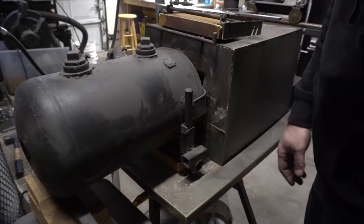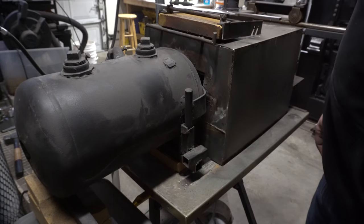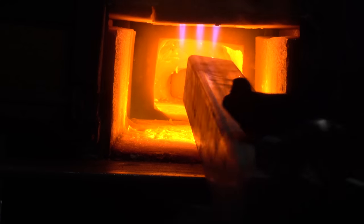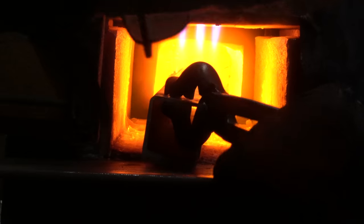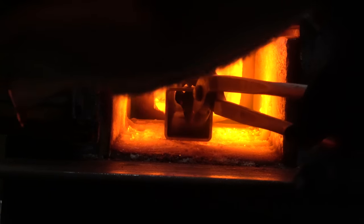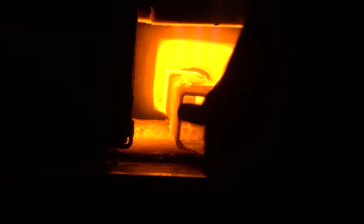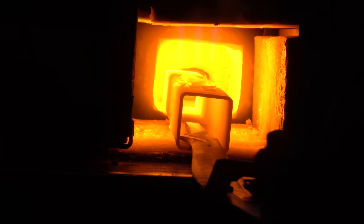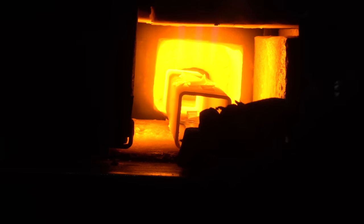Now I've got to figure out a way to have an even heat across the whole thing. Once the forge has gone up to temperature, I use this stainless steel tube so I can put the blade in it and have a more even heat. When heat treating in the forge, I always put the blade in tang first — that's always the thickest part, so that part needs to heat up, and then I flip it around.